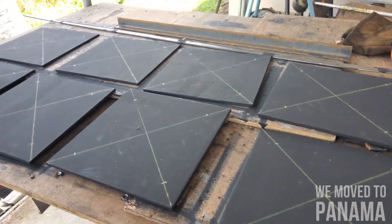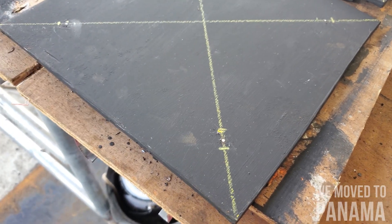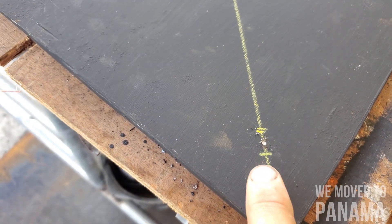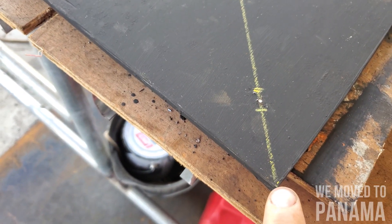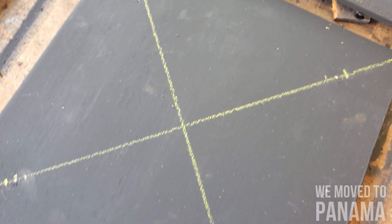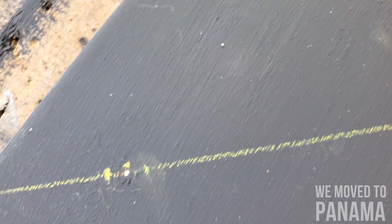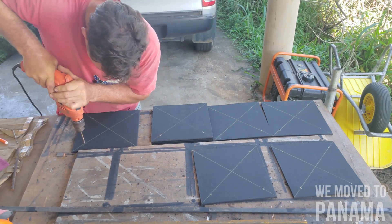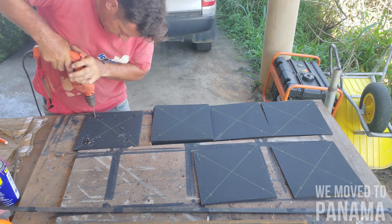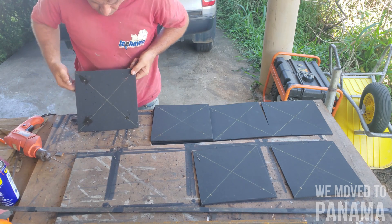All the markings are done on the plates. The hole will be drilled on this side of the line. I just mark my spots where the actual drill bit is going to go — that is just to make sure that the first line is five centimeters from that point to that point, and the actual drill point will be in the middle. Like this plate over here — you can see the little spots. I just drilled a touch but now I'm going to drill deeper.